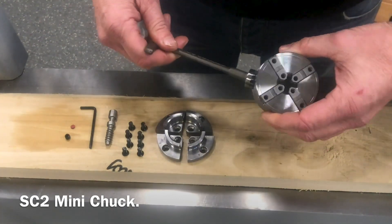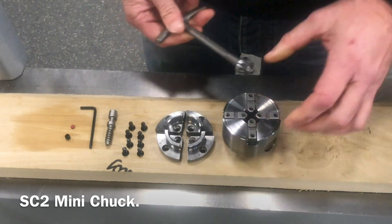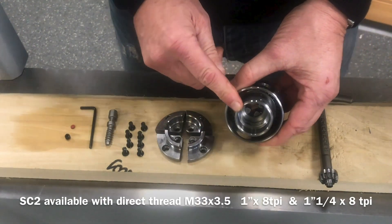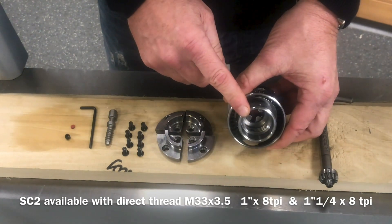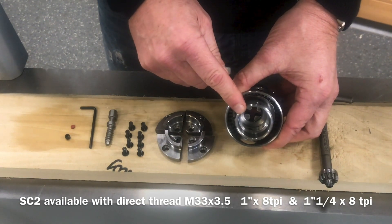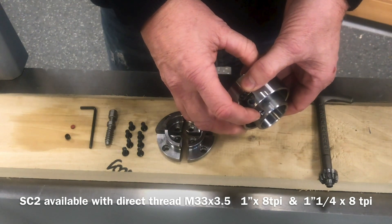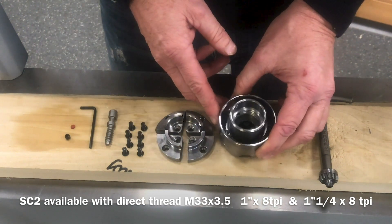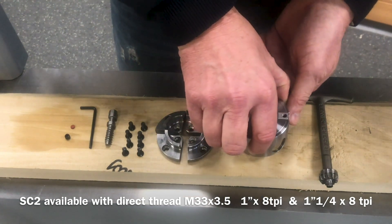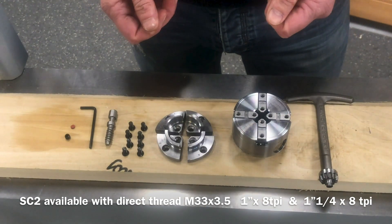The advantage of the bigger scroll ring is that it will hold bigger work in expansion, contraction, and square stock. The chuck key locates again — right to tighten, left to loosen. One of the other differences with this chuck is it's a direct thread, in this case M33, to complement the range of Record Power chucks and lathes. Also available in 1¼ inch 8 and 1 inch 8. You can see the drilled and tapped M6 hole that accepts the leather pad and grub screw to locate onto the spindle nose for safety when doing reverse turning.